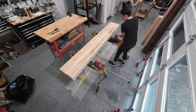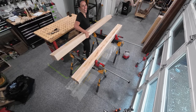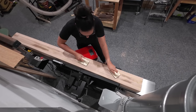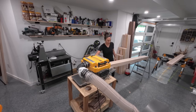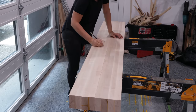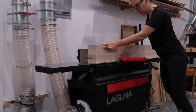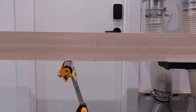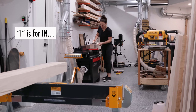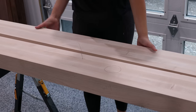Another reason to do this glue-up in halves — even at this point these halves are super heavy. Each half is about six inches wide, so I was able to clean up one face at my eight-inch jointer and then bring to final thickness at the planer. You can just go ahead and glue the two halves together at this point, but I really want to make sure the mating edges are seamless, so I did the in-out method at the jointer. One piece is sent through with the top face facing out away from the fence and the mating piece is sent through with the top face facing in towards the fence.